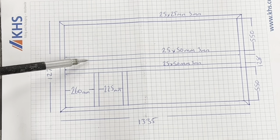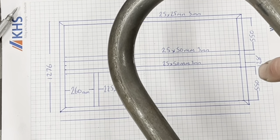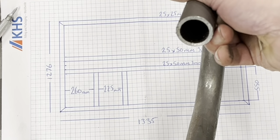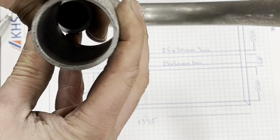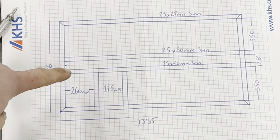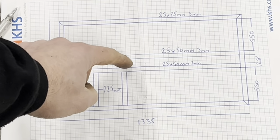And over this, as I use this as an exhaust tunnel, I run these hoops. These are 1-inch CDS. I think that's also 2.65 mil wall. So that is the same wall as my roll cage tube, which is massive. Strong as fuck. Sorry about the language. And I hoop them over here. There's only like 4 of them, which helps tie this section in together.